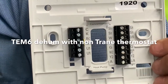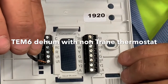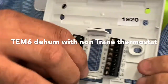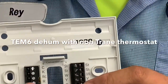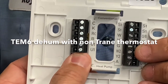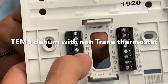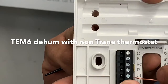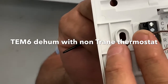The way you would make this work is that brown wire — we're showing the black right now, but it would be the brown we just hooked up — you would tie it in at the thermostat. Color is irrelevant; we just used brown in our example. You would tie it in on the bottom U1 connector. Then you have to put a little jumper and bring it down and tie it in to U1. So put a jumper on the top U1 and bring it up to red.